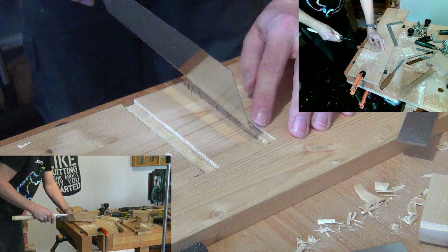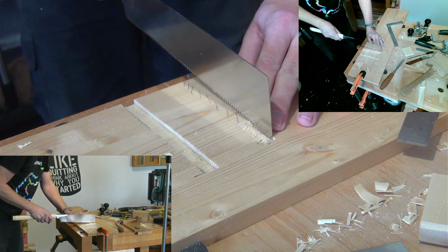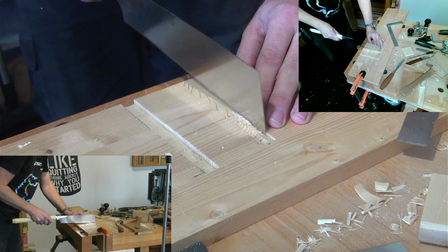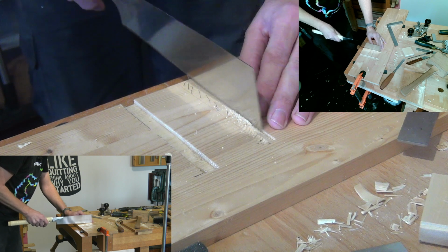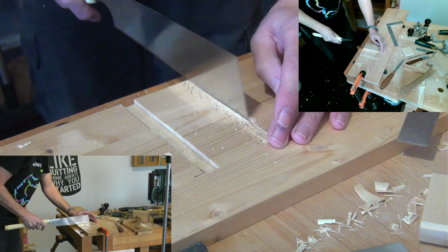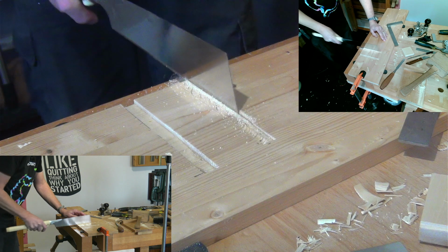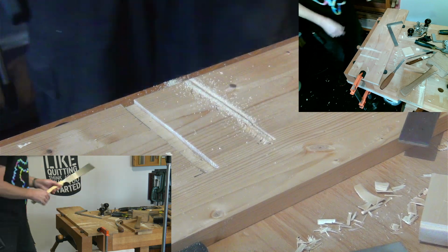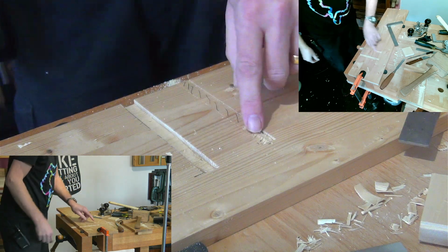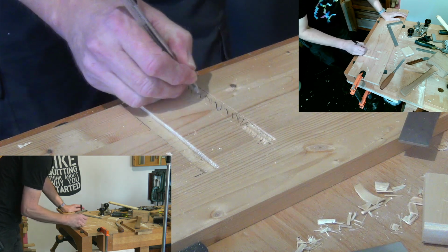which you can now put the toe into this little area that you've created. That gives you the option then of being able to saw down the depth on that side of the housing. You could do that both sides. That would then give you this square area of waste to remove.